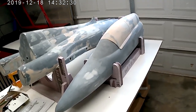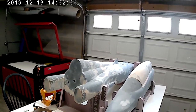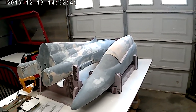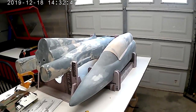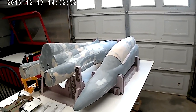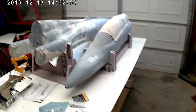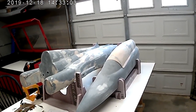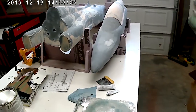That basically gets the main — pretty much the whole fuselage at this point — ready for a couple final coats of primer. That would be Duratec primer so I can get it on there and wet sand it down, polish it, and make it nice and shiny, which is something I typically don't do on plugs, especially ones that are going to be kind of military. They just spend a whole lot of time to either dirty them up or put a flat or semi-gloss paint job on it that doesn't really show all of the effort that went into making really nice, smooth, shiny plugs. So it's kind of wasted effort in my opinion, but to each their own.